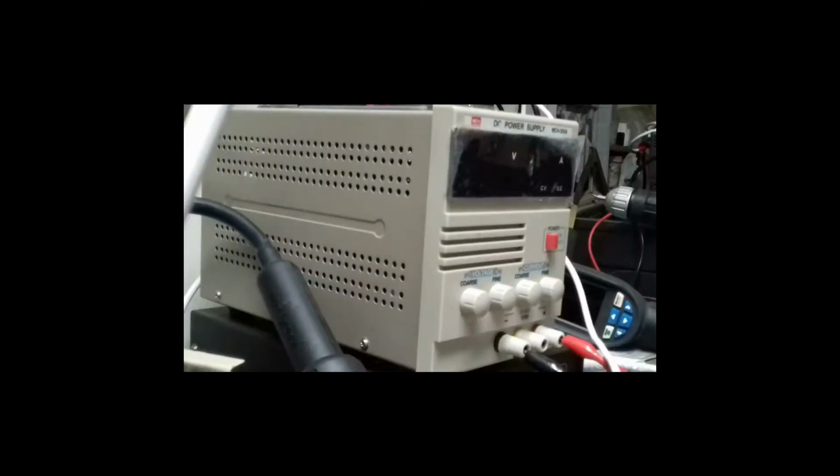I will suggest that you use two good quality 10 turn variable resistors. They are accurate variable resistors, and you will be able to control the voltage and current very accurately. You can also add the connectors like you have in a proper bench power supply. You can put the knobs and connectors as found on a normal bench power supply.